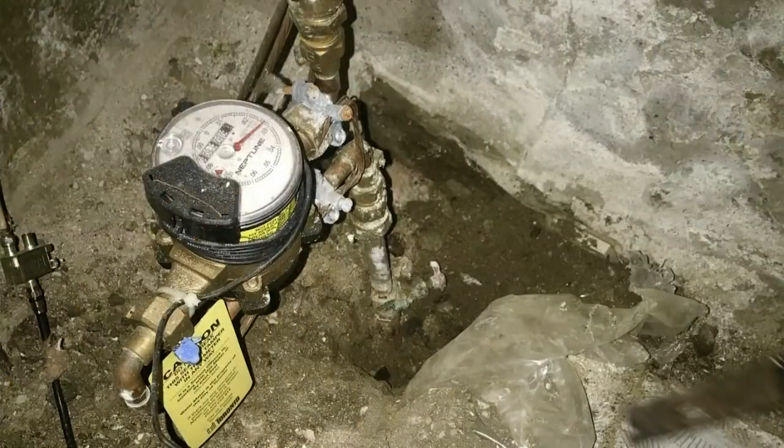The next picture shows the main water shut-off in the house. When I first walked in there was no visible water shut-off lever, and when we dug out the floor around the water meter we found it was below the floor. You should have water shut-offs under every sink in a bathroom or kitchen. If you don't, you may have to run to your basement shut-off during a leak — so everyone should know where it is. If yours looks like a knob, ideally switch it out for a lever, because with a lever you can tell at a glance: if it's parallel with the pipe it's open, if it's crossed it's closed. That's really useful for your outdoor water shut-off as well.